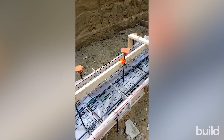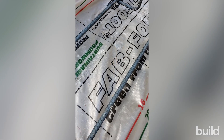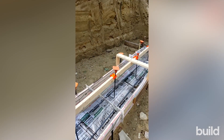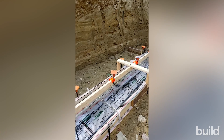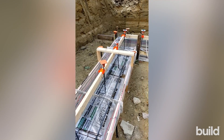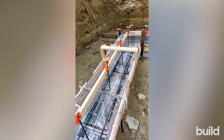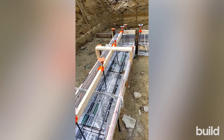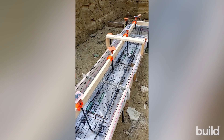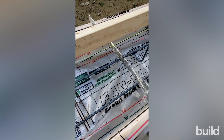The reinforcement really doesn't work unless the rebar is fully encapsulated in the concrete. On close inspection, you can see the rebar has a knurled edge — that's not by mistake. It increases the surface area of that dowel and gives edges for the concrete to grab. As the concrete goes around it and cures, it basically locks onto it. If it were a smoothly milled bar and you played tug-of-war on it, you'd have nothing to bite, but with that knurled edge you can really apply force.